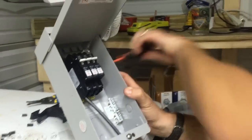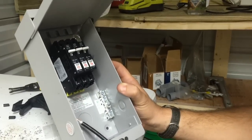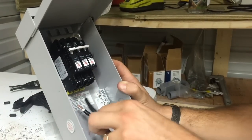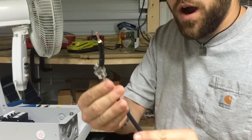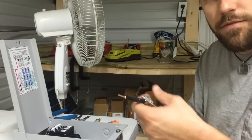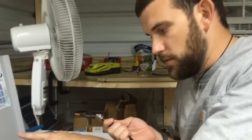You'll undo the screw right here, undo this screw, and pull this wire out — just back it up. You'd take your replacement diode, put it up into place. Right before you put it in place, where you pulled that wire back, you would crimp that wire up into the female push-on connector. That replaced the diode — it puts a diode in line. It also keeps the diode up in the box, so if it ever overheated, there's no fire hazard — it's protected in a shielded, UL-listed box.